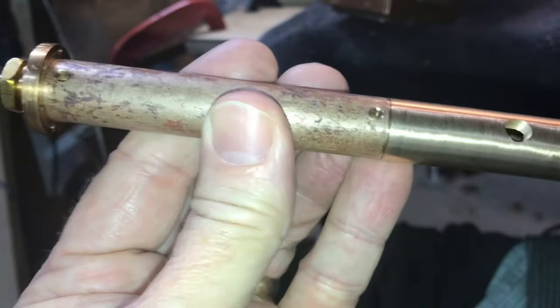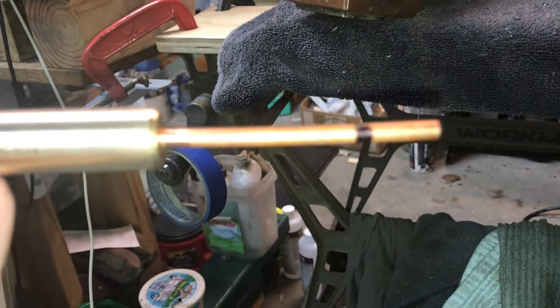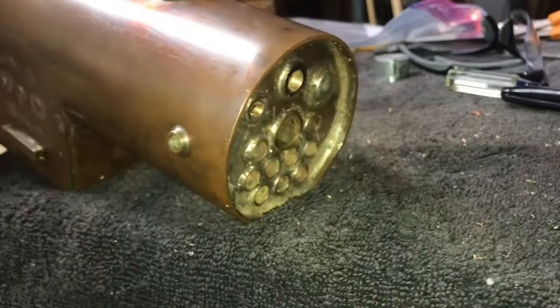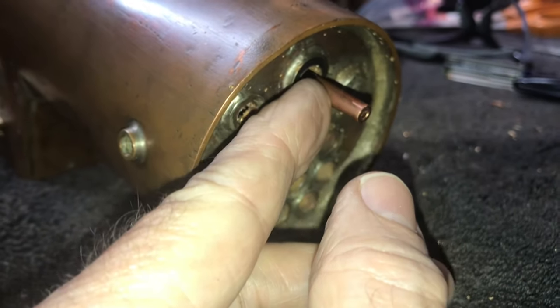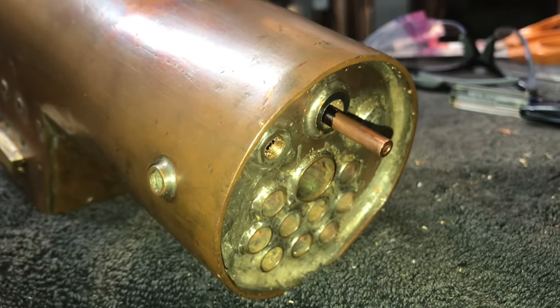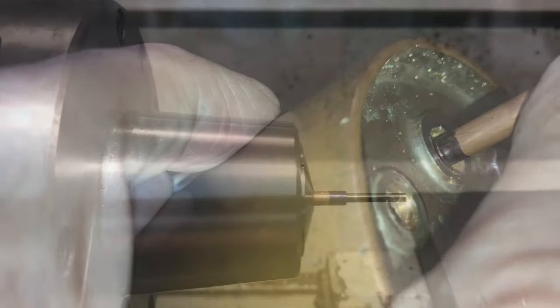For fitting the regulator into the boiler, I've test fitted a piece — I've got a piece of 3/16 inch copper tube screwed all the way into the front of the boiler, the regulator rather. I put it in place in the boiler and slipped this in. I need to make sure the throttle is all the way home. You can see I marked it with a Sharpie marker, and I'm going to take a razor knife and scribe a line as close as I can get it to flush with the edge. Then I'll know I can cut it off a little shorter than that and thread that end so that it will go inside the threaded portion of the steam header. That ought to work out pretty well for cutting the pipe off and threading it.